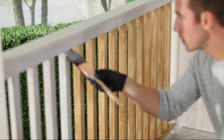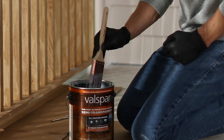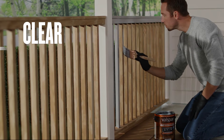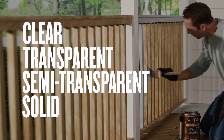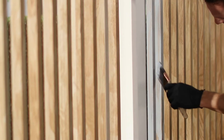There are a few stains to take note of that will impact the final appearance of your project, like transparency and color. Common types of stains include clear, transparent, semi-transparent, and solid — each increasing in opacity, or the intensity of the pigment in the stain. Semi-transparent stains are the most popular as they hide imperfections, show texture, and look premier.